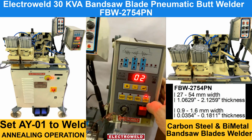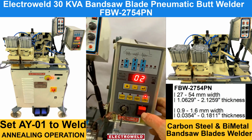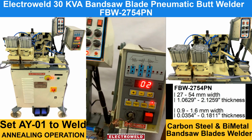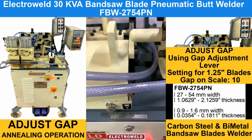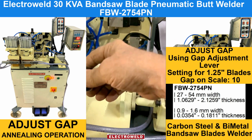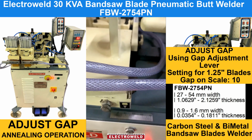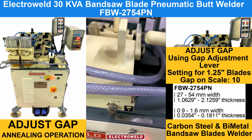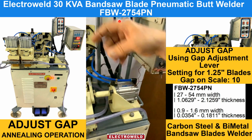When you want to do the welding, you have to switch on this knob and then you can start welding after adjusting the gap between the two welding jaws. This is a gap adjusting lever. Now at the scale to read, you can adjust to say about number 10 for welding the 1.25 inch blades, and pressure we already adjusted.